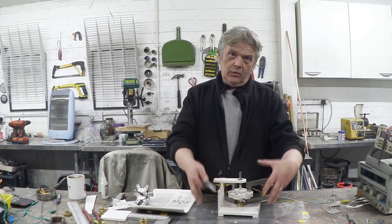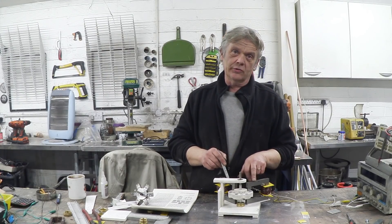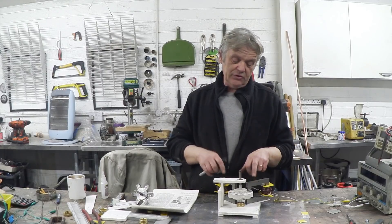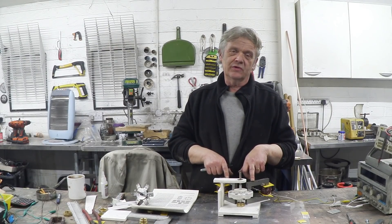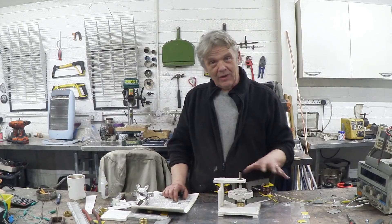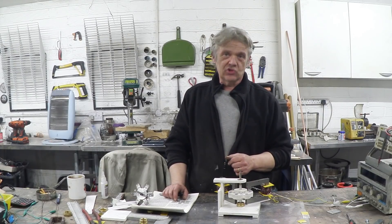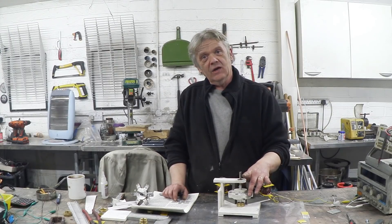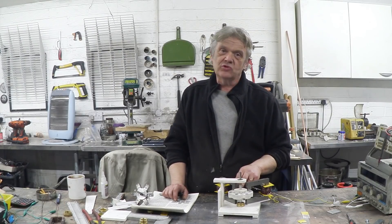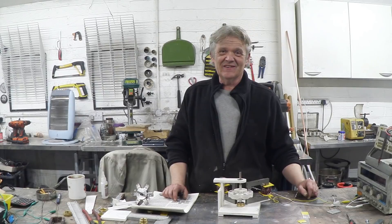So we are getting toward the motor that we want. I just switched those by hand — what I need to do now is build some electronics that will switch them. It looks like two coils would be enough to get that rotor to turn; two coils or pairs of two coils will be sufficient. We've actually built the prototype. We now need to put some switching in to get continuous rotation, but the on-off stepwise motion is certainly working. The disc is fine in plastic — axial flux motors tend to use non-ferromagnetic materials like aluminium for heat dissipation, and plastic is just fine. Hope you enjoyed the video and thank you for watching.